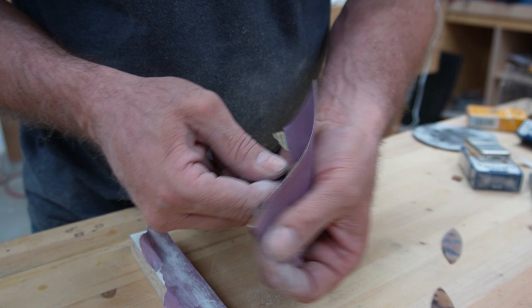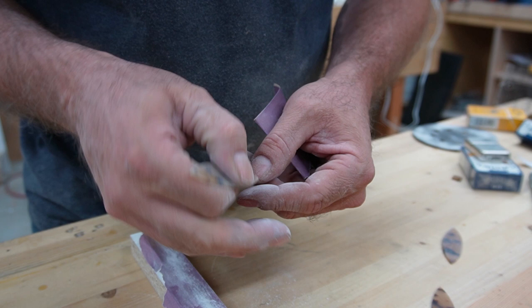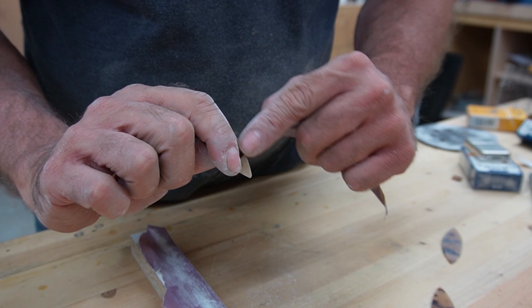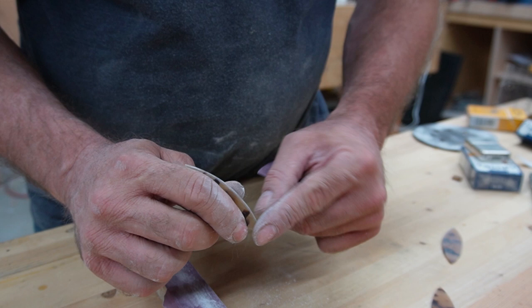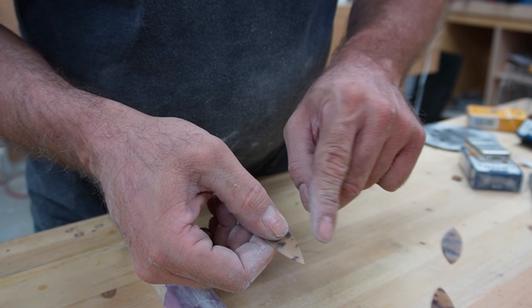And if you have the speed bevel sort of be this surface and then you flip it over that same corner, most folks seem to keep their picks angled down a little bit. So if you have that bevel as it glides across the string, it's just kind of a little bit of a helper as opposed to just kind of round. But I'll usually taper the forward facing left corner. No matter how it's oriented, it'll all get the same bevel there, and it seems to work pretty well.